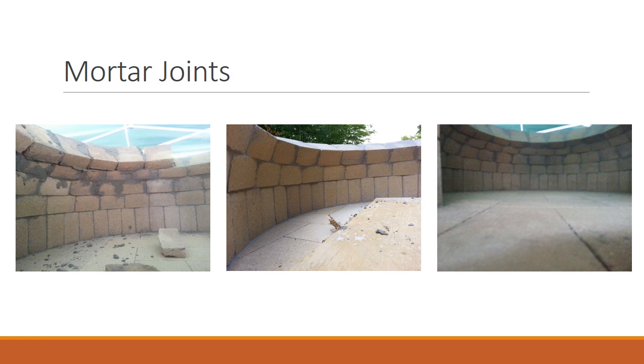This is what I was talking about. So these are unwashed joints right here that we've just laid in. So we'll then come back, we'll take our fingers and make sure that that mortar is all nicely pressed into each joint, that there's no cracks, no crevices, no holes. And then when that's done, we'll come back a couple of times and we'll wash the joints. Look how nice those joints are right here. And any gaps are filled in with mortar. This thing has to be airtight.